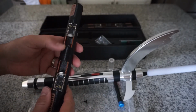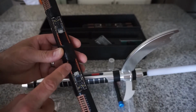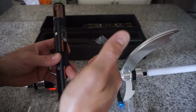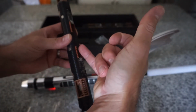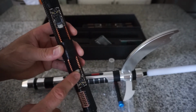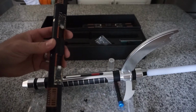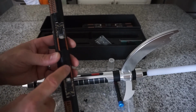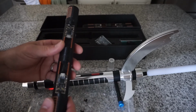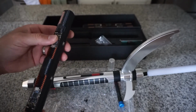kill keys. I believe Korbanth will supply you with a charger and a 1.3 adapter. The recharge port is at an angle, but if you don't use the proper adapter, you're going to wind up hitting the USB port here, and some adapters you won't even be able to get in place. So Korbanth should be giving you the right adapter so that it works and fits and doesn't touch or potentially break the USB port. Be mindful of that.